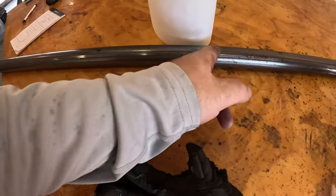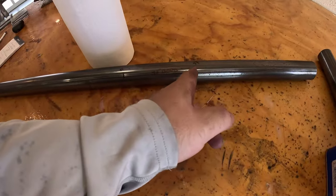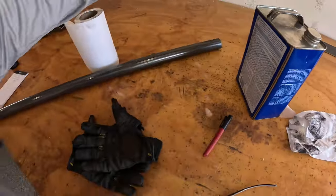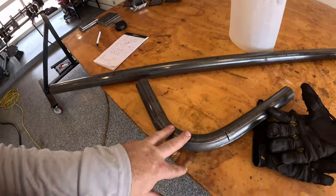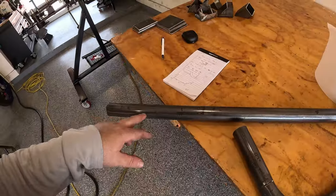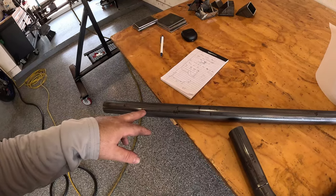We've got 20 inches for our straight piece, and then 5 more inches for our 45 degree bend. And then this will continue on straight. And I know these values because when we built our cheater piece, I know that there's about 7 inches in this bend. So we're going to start basically right at this bend.